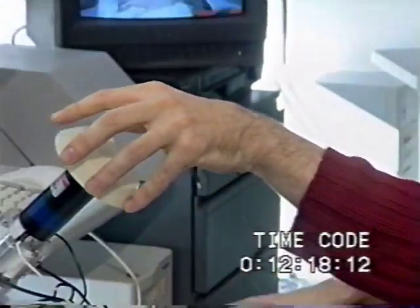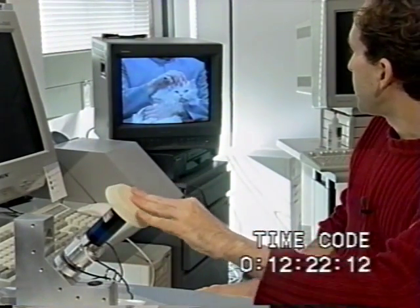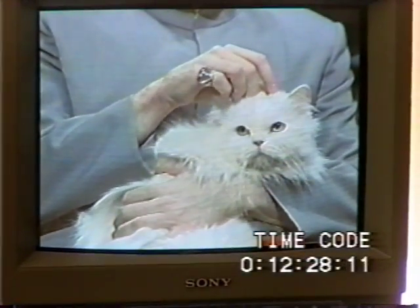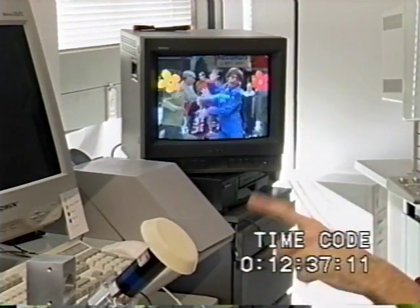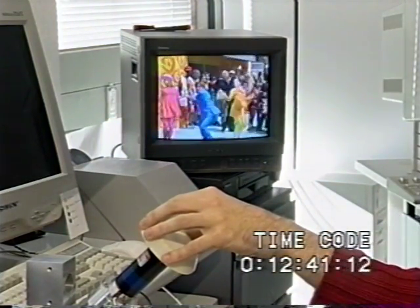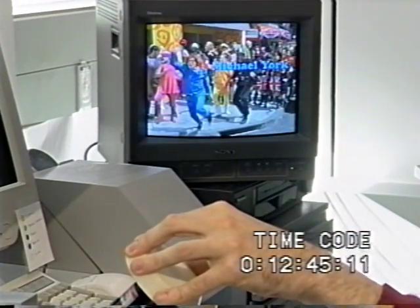Here's how this works. If you press tightly, the two wheels are interlocked and you can advance video frames continuously. This wheel has a little bit of inertia, so you can actually feel its heft as you move back and forth. If you push and then release, you'll notice that this wheel isn't moving but the video moves forward — that's because the inner virtual wheel is spinning based on our dynamic simulation. Now, if you start to push down, you can feel bumps scrolling by, and if you push hard, you can actually stop the system. If we get it going really fast, it actually takes a fair amount of force to stop it.